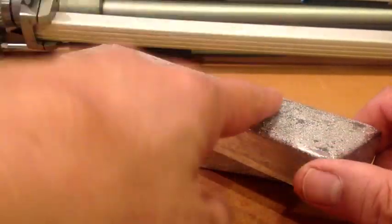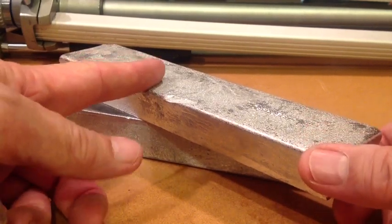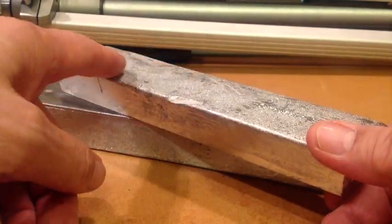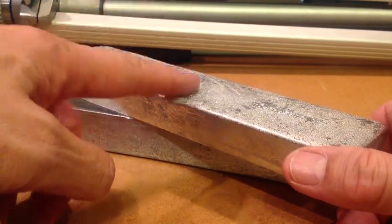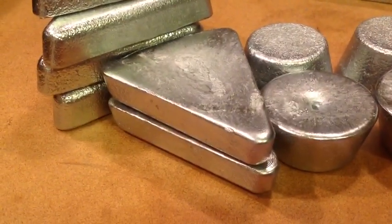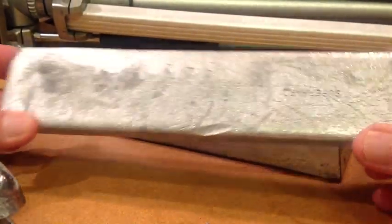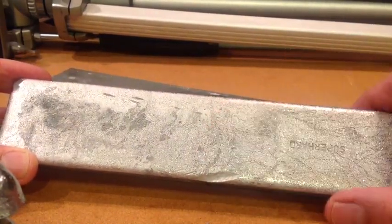Now, it turns out that super hard alloy is 30% antimony, and antimony has a crystalline structure in the alloy. So it's no wonder that the surface here looks a little grainy — that's the 30% antimony. If we had a bar of linotype, it would be much smoother on top, because without the 30% antimony the crystalline structure would be smoother. But this is understandable — this is not dirt. This is the crystalline structure of the 30% antimony. And it's clean.